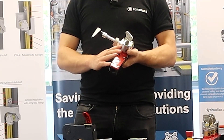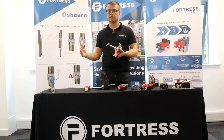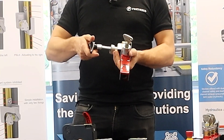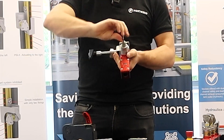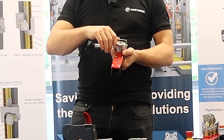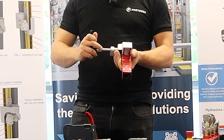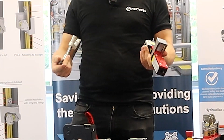What you'll notice is we've fitted a key here. From a technical standards perspective this is referred to as a proactive inhibit function, but in more common terminology you might call it a personnel safety key. The way it works is that the guard, despite having no electrical locking mechanism, is actually locked until I turn that key and remove it. Once I've removed it I can put it in my pocket. We then have the ability to lower that bracket over the lock and open the door.